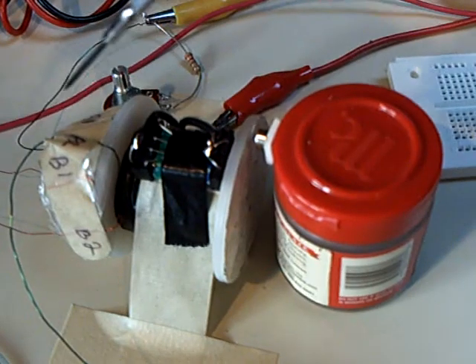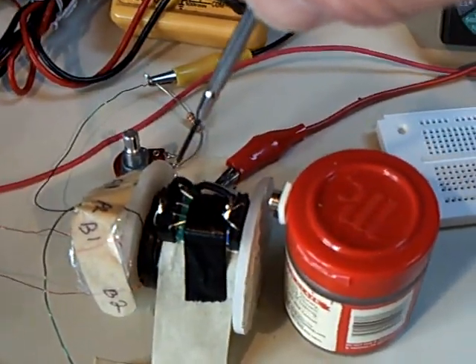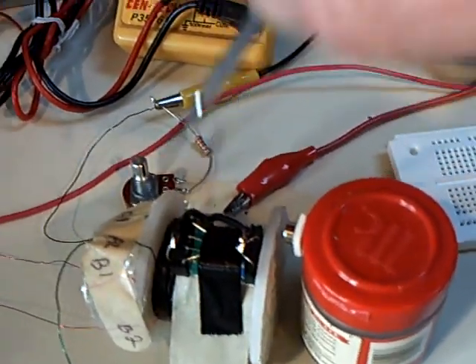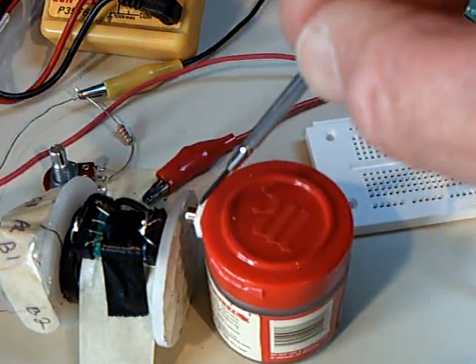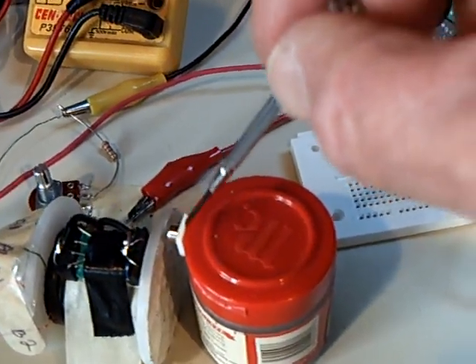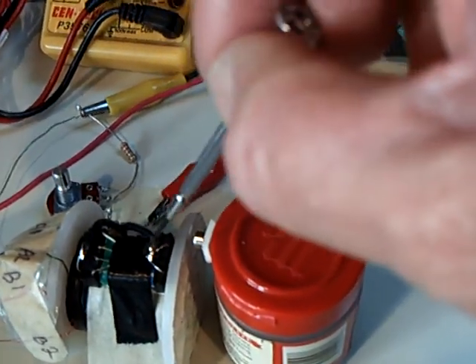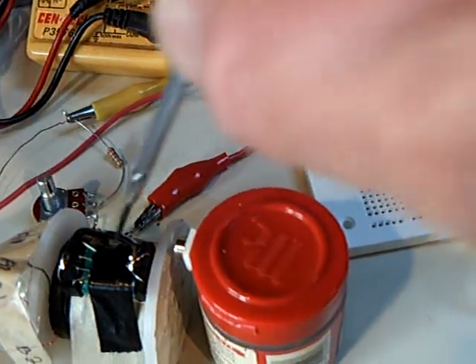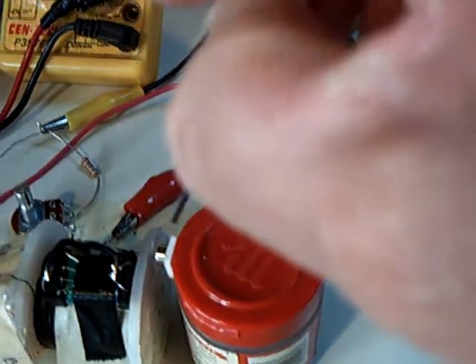This is not as good as it should be. The primary winding is about 200 or 300 turns — it should be 700 windings, so I don't have a very efficient bifilar coil. That's the little neomagnet there that is extremely finicky with these reed switches. Getting it dialed in is very difficult on this system — that's its Achilles heel, the downfall right there.